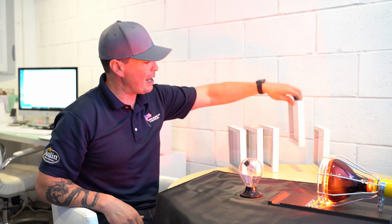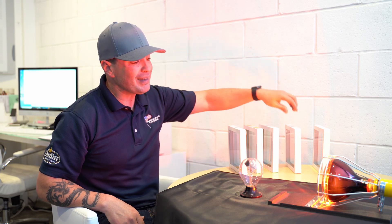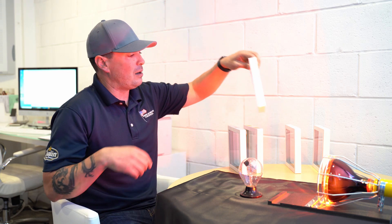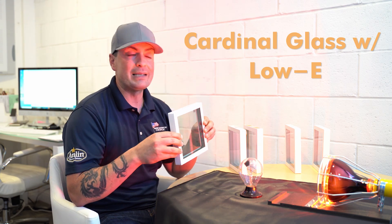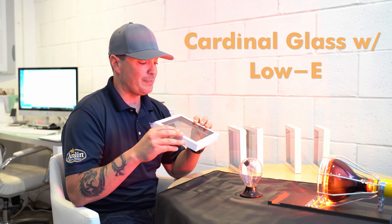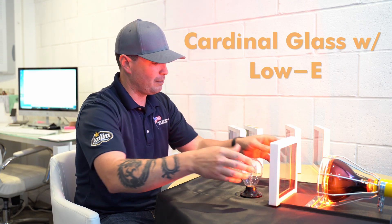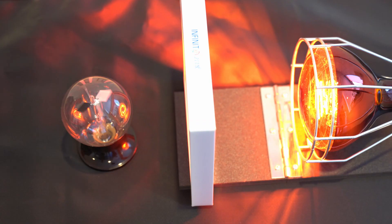Let's pull this off and our globe is going to start warming up immediately and speed up again. The next is Cardinal 366, which is three layers of low-E — a silver coat, very high quality low-E. Now we put this in front of it. I felt the heat really reduce once I put that there, and we watch the little globe and you'll see that it's significantly starting to slow. If we left this here it'll start to crawl basically. In a perfect world you want it to stop altogether, but it's slowing very fast. This is really high quality low-E here.